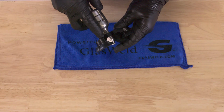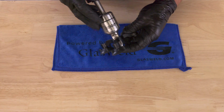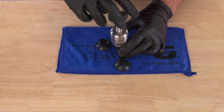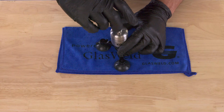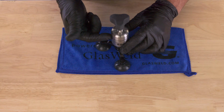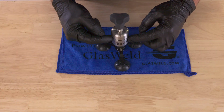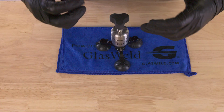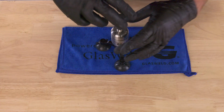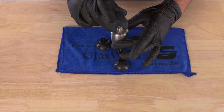Immediately what that will cause is that when you start to do another repair, you might get this automatic turn down effect, where the upper piston handle basically starts to turn down on its own, and that's because the resin is in the upper chamber. It's lubricating that seal, and because it's so thin, it doesn't resist at all. So it basically causes it to turn slightly down.